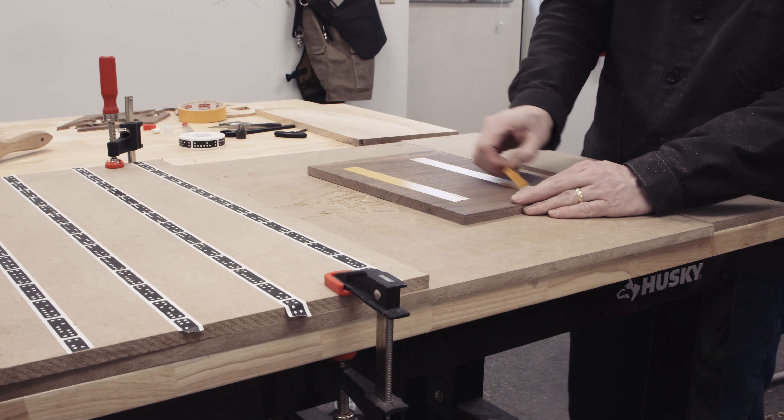Here I've set up a half inch tape board to cut the plaques. I'm starting with the Overwatch plaque, securing it with double-sided tape. I'll scan the piece in as always and start with a quarter inch bit doing a pocketing cut at 0.1 inch depth — that's a little less than the 0.11 inch used in the inlay pieces, just to make sure they can fully seat. For these cuts you just move the router around, coloring in the shape on the screen.